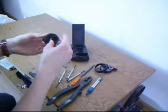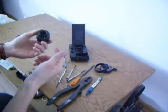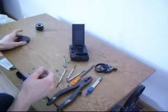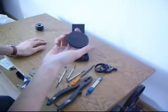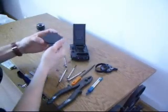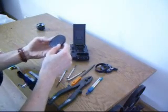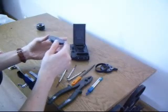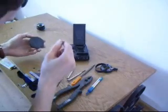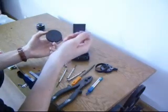Okay, so screw it with the nut and put it back — we will need it in the future. Now let's take the cap. We have to drill a hole in the center of it, a 25mm hole. It must be as precise as possible, because if it's not, all your work will be lost. The best way to do it is to make a small hole in the center first, and then make it bigger with a bigger drill.